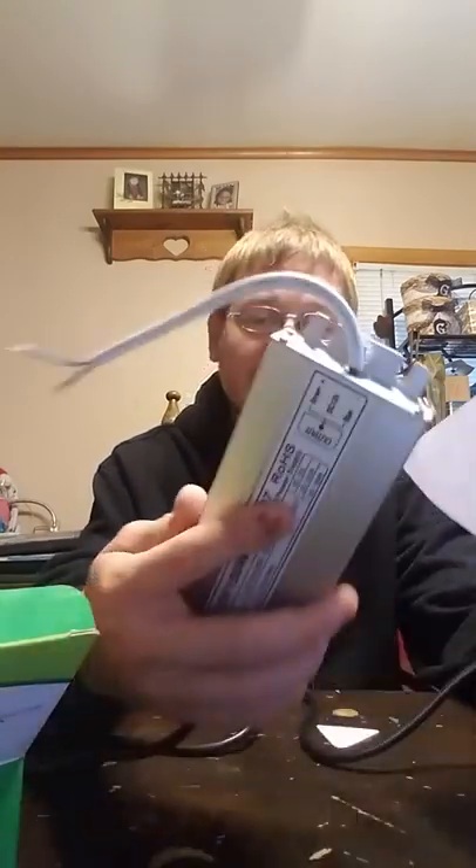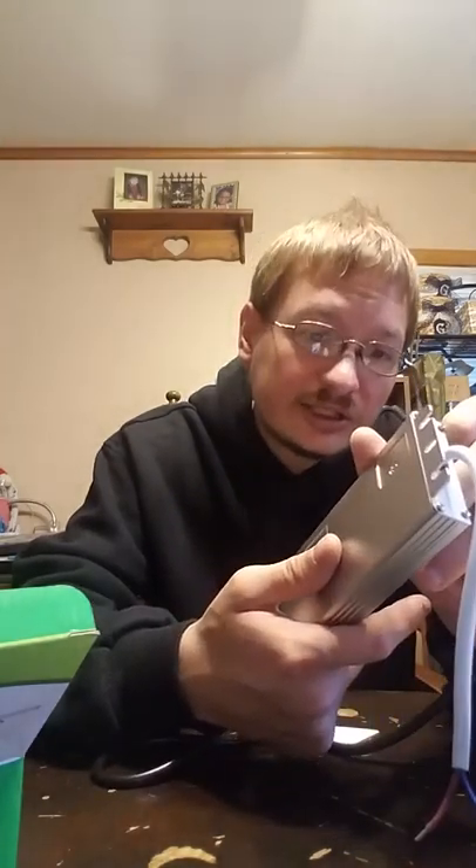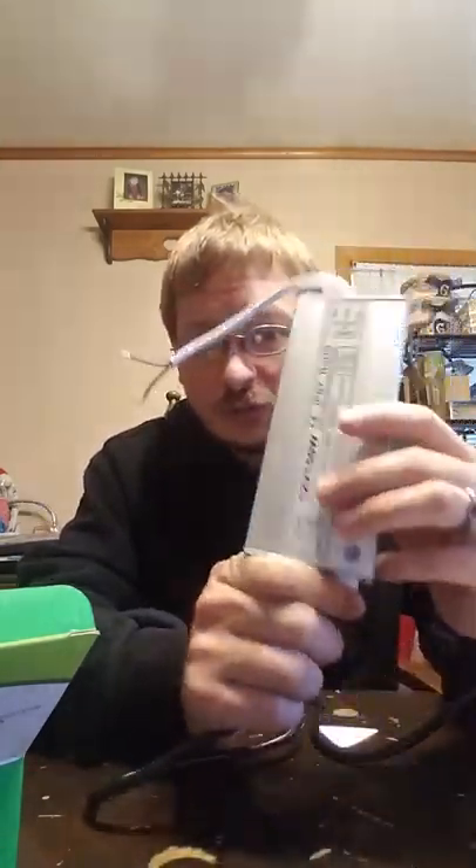This is for LED light strips. Efficiency is 85%, working temperature is negative 13 to 104 degrees Fahrenheit, humidity 20% to 95% with no condensation, waterproof grade IP67. It's pretty decent waterproof, but as I said it cannot be submerged, so make sure you put this in a dry place when installing.